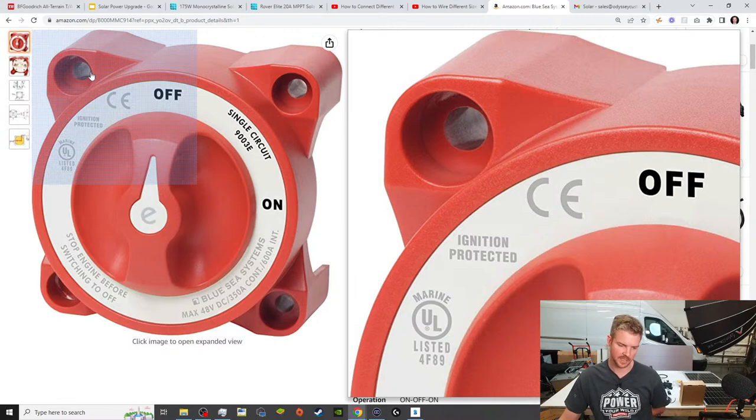yeah, that's right, Daniel. They use a single pole, not a double pole. So it might break the circuit, but then it's just going to come back down the negative side. So yeah, you want both the negative and the positive disconnected at the same time. You don't want to have the negative grounded to the van, and the positive the only thing that's breaking the circuit,